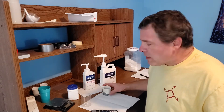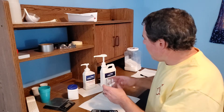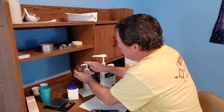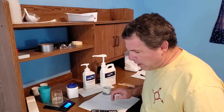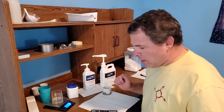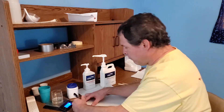Now we're ready to mix everything up. I'm going to use two pumps of the resin and then two pumps of the hardener. I'm going to weigh that so we can calculate exactly how much potassium nitrate we need to add. It's 63.1 grams, and we know the plastic container weighs 16.6 grams, so we subtract that — we have 46.5 grams of epoxy. We divide that by 35 and multiply by 65, and we come out with 86 grams of potassium nitrate needed.